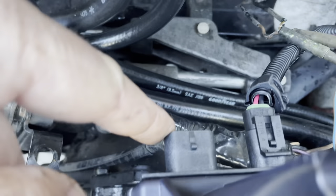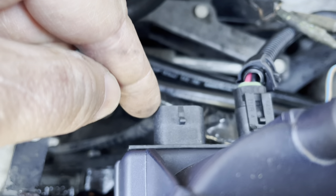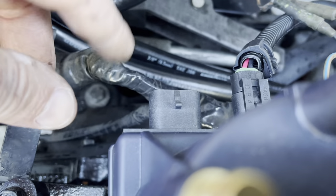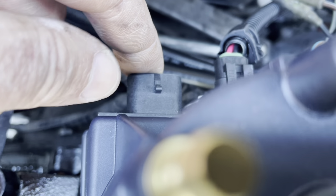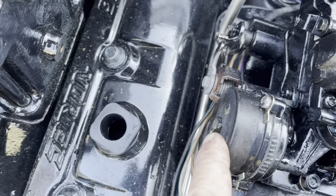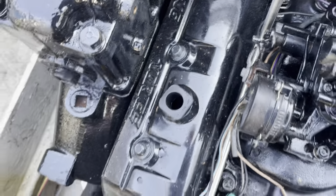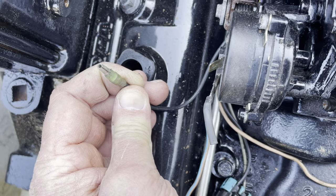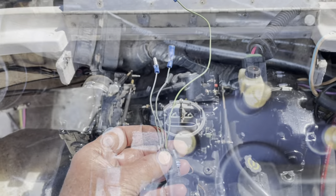All that's left is this connector here, which you have to wire up to do your shift kill. I'm going to do the shift kill just like it's done with the four-cylinder three-liter MerCruisers. You use a four-pin connector — for set timing, pins E and R are tied together. For shift kill mode, you leave pins E and R unconnected, and pin B, which is bypass, goes to 12 volts. Your shift kill switch then switches 12 volts to pin B here. The shift kill switch will be mounted here, and I'm going to pick up 12 volts from the choke wire and repurpose the old shift kill ground wire as the new shift kill signal going back to terminal B on this connector.